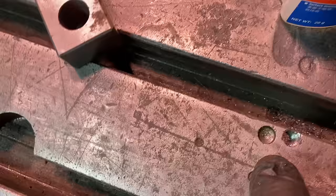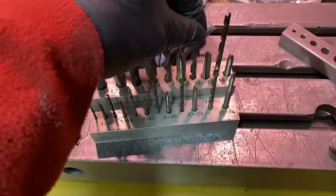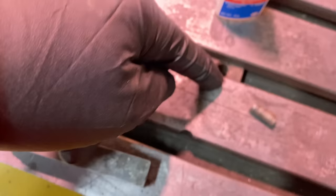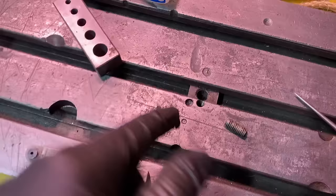You can see that down there. I'm going to use that to make sure I don't go down too far. This hole was actually already drilled — at my tap gauge it's 5/16-18. I took the drills and it fit in there just perfectly, so I tapped it, and I'm going to try putting a bolt down there. One problem is the threads are actually a little bit visible through — I don't know if that wall is going to blow out. I'm going to try to put some Loctite 401. I don't have any red Loctite — I think red is the better kind.